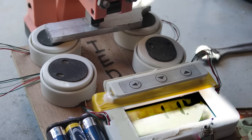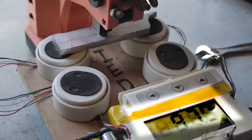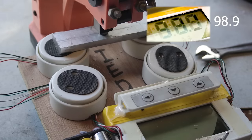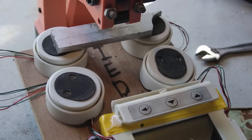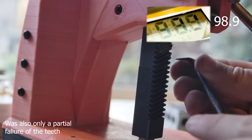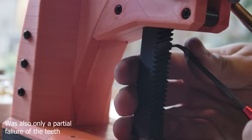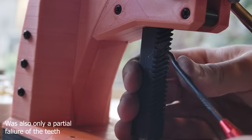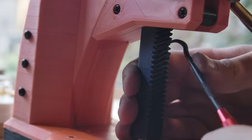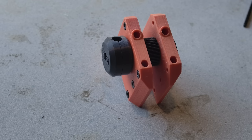Let's try this again. Oh, it was so close to 100! What broke? What failed? I think it was the rack. 98.9 kilos of force — comedically close to the goal of 100 kilos. Realistically, it felt fine to use up until around 80 kilos. It was more force than I expected from small printed gears like this. The helical gear also took zero damage — it was all in the rack. Now I'm curious: just how much force could these gears take?